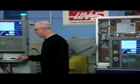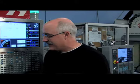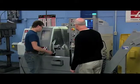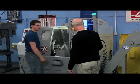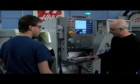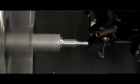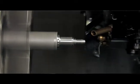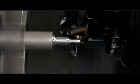He's over at the other part of the machine and getting ready to put the stock in and get us all set up. So Rob, tell us what you're doing. Okay, so basically we're taking a 1-inch raw piece of round stock and we're going to turn it into our part that we made all the coordinates for. All right, show us what you're doing. Now, how long will it take to make the part with the code that we put in here? It has a cycle time right there. About 3 minutes, 39 seconds.